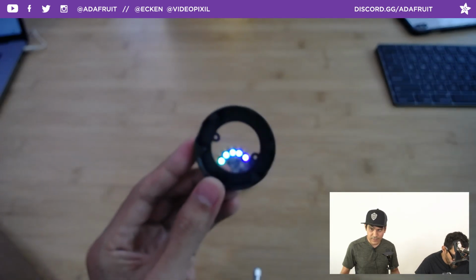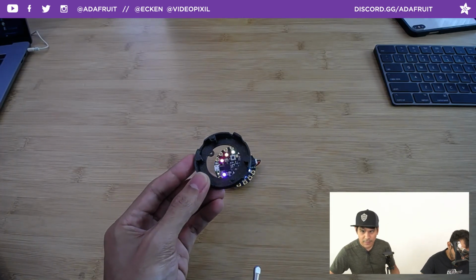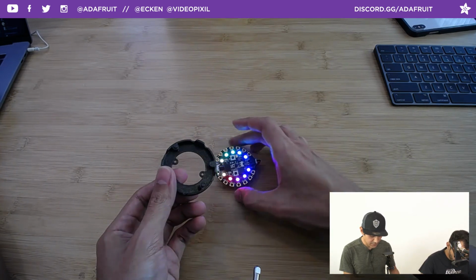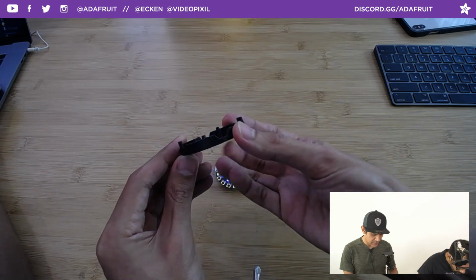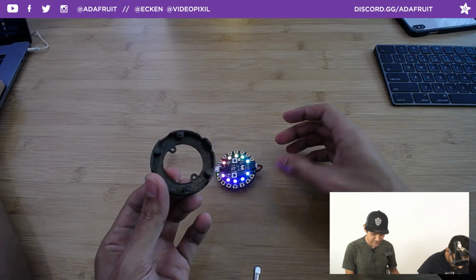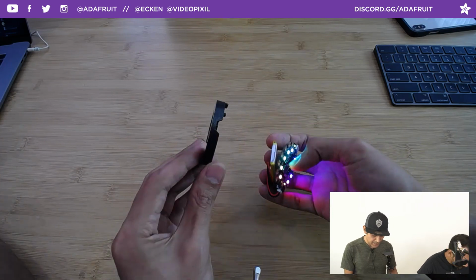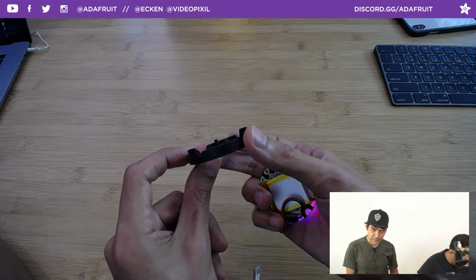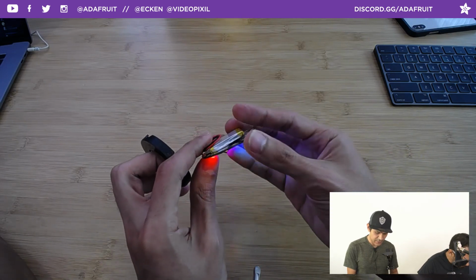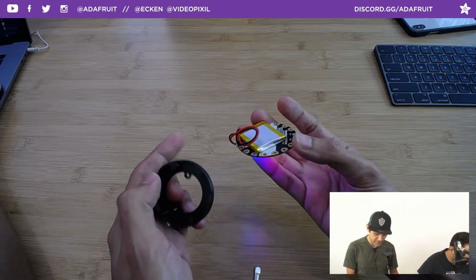Very, very simple and clean. Just to focus there. You have two little pegs here that go into the mounting holes. That's what keeps it in place. And then these two tabs have little nubs that keep the PCBs down, secured in place. The standoffs are about 6 millimeters tall, so that you have enough clearance for a LiPo battery with a cable. This 500 milliamp LiPo battery works pretty well.